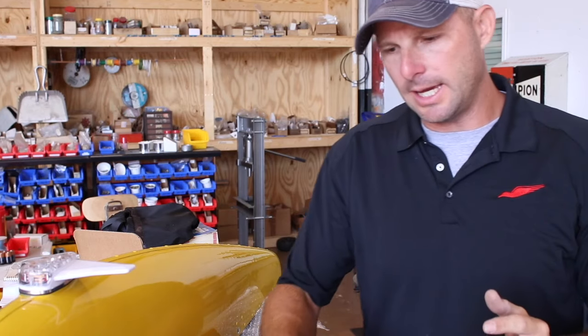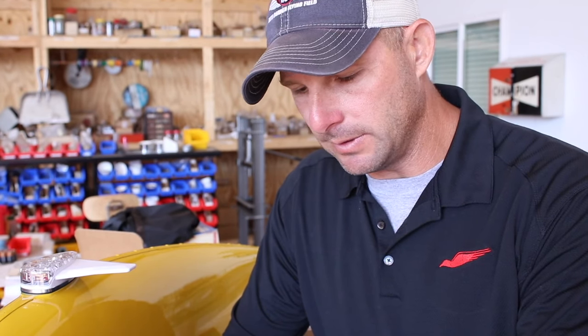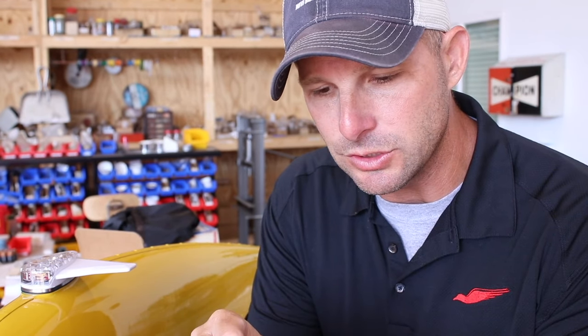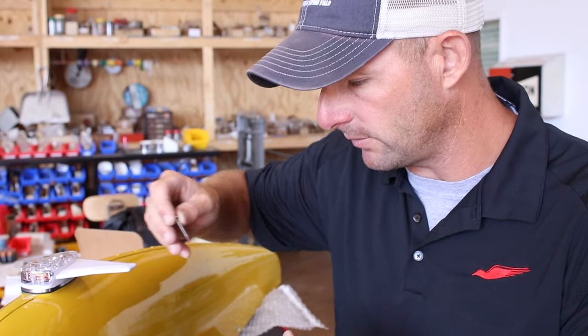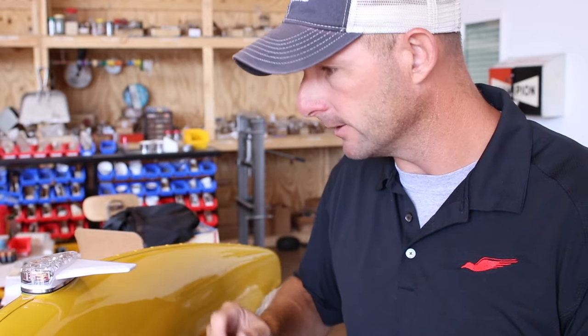Okay, so per the uAvionix installation manual, you have to use their mounting hardware, but they have a great packaged set of hardware for the installation. On each screw, you have to put two O-ring washers, and that seals the unit once it's compressed and tightened up. That seals the screw heads from any moisture getting into the nav light here.